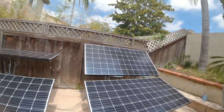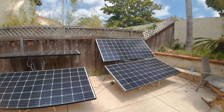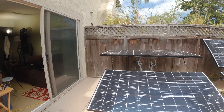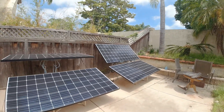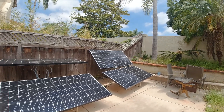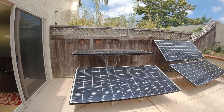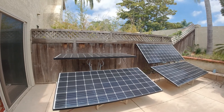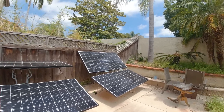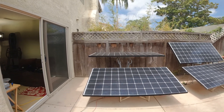These panels put out about 50 volts open circuit and about 9.2 amps — a pretty good profile for smaller solar systems. It's higher than the mobile panels that people use, but it's not as high as a lot of the big panels. If you get above 360-watt panels, most of the time the open circuit voltage — the VOC — is like 65 volts, and that can overwhelm a charge controller.